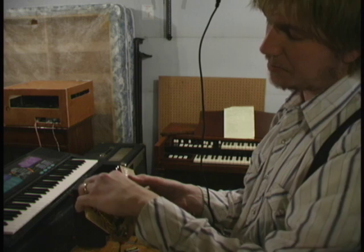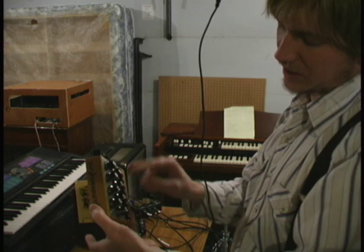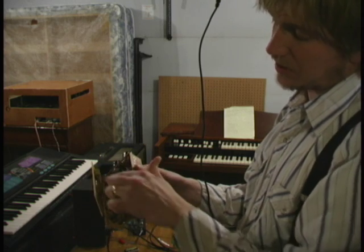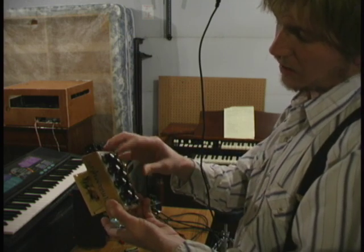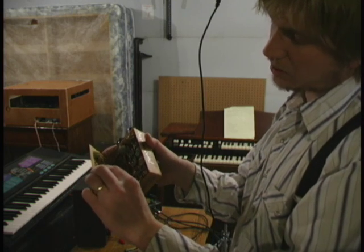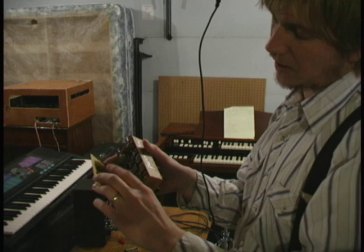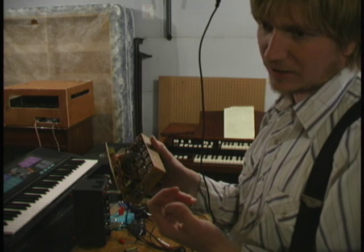There's a series of 10 pins on there. I've only used eight of them — it will count to 10, but I only count to eight. And that's all that chip does. Each of those basically count the LEDs, and then off the LEDs I pull another line off and go to each of these 4066 chips.